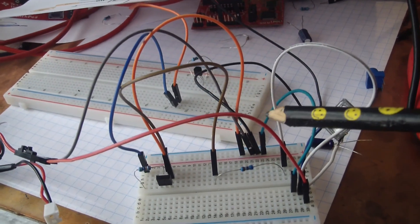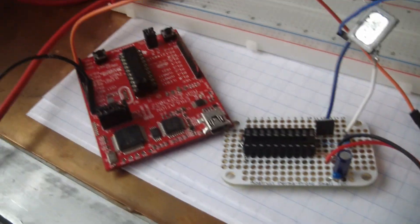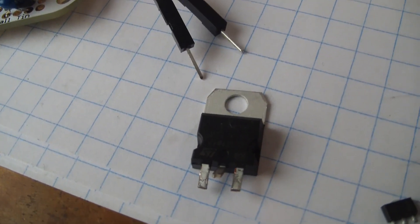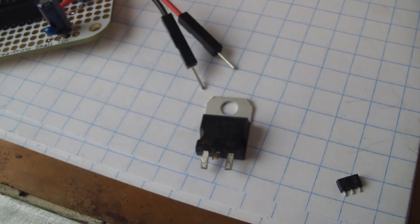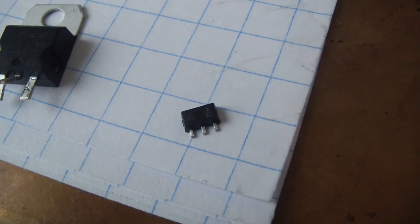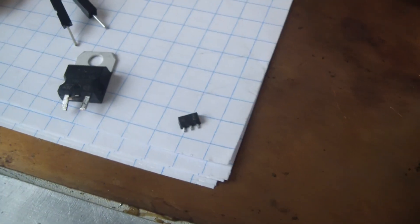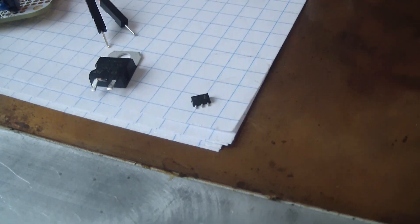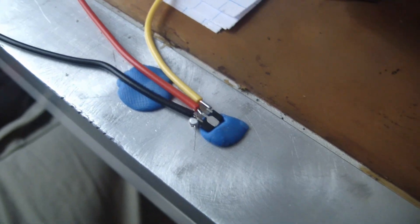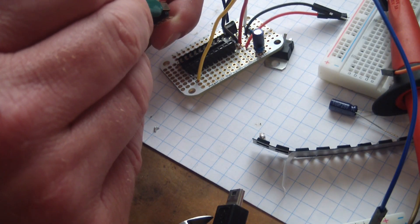So now we can take the temporary setup and make it semi-permanent on some Vero board. I got the Vero board up. Unfortunately, I can't get her to run with the chip in, because this LD33 voltage regulator — the only one I had in the junk drawer — is outputting 0.7 volts. Son of a diddly. Took me a while to find that out. So all I got is this stupid thing. I guess it beats a trip to the local electronics store, 60 miles away and overpriced by a thousand percent. Oh, Canada. You guys in the States don't know how good you got it.